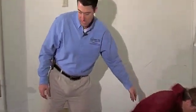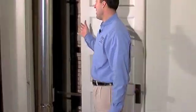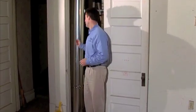All right, well, I won't hold you up. I'm going to go over here and show what we've done in the closet to accommodate the stack, which is really where all the heat is going to come up and the air is going to travel up to the third floor. And we decided to use this closet as opposed to other areas. It does take up the closet space. It's not our favorite solution, but it's necessary for getting everything to travel with the current space in the home.